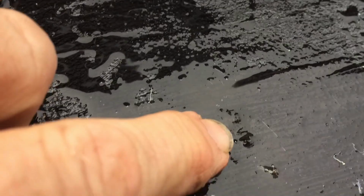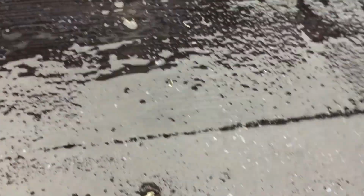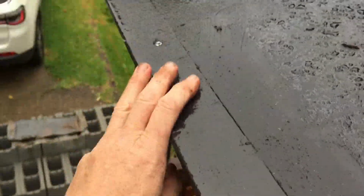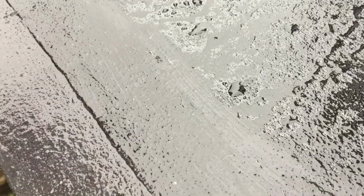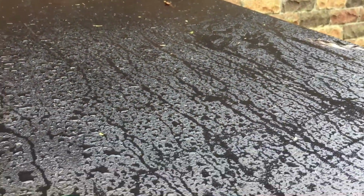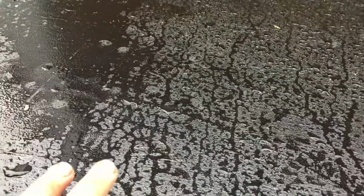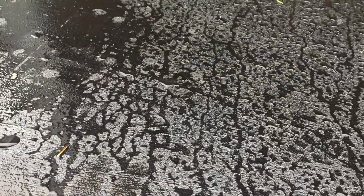Like I got these ones here for this. It's the last strip. These ones got washed out. I dare say it's meant to be hot tomorrow because that's what the forecast was. I'll have to put some more waterproof across this. I'd like to do another coat across the whole thing, I think, and then get the flashing up on there, and that'll keep this secure and weatherproof until we get the asphalt shingles.